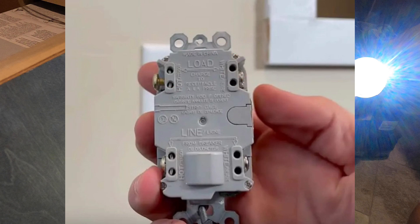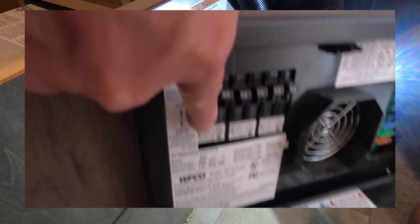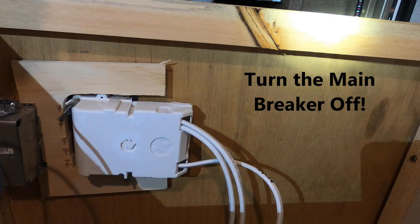There's a plan B, so don't worry. You can see there are three sets of Romex wires leading to this box — you will be adding a fourth wire to supply power to your new outlet, which is why you need a standard size junction box. What I did was turn the main power back on, then used an electrical tester to see which wire was hot, and then I labeled it. This hot wire will be connected to the line side of the GFCI outlet — you can just see the label 'hot' right there.